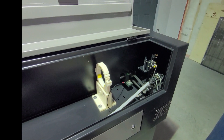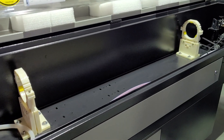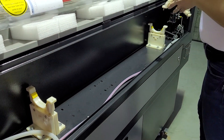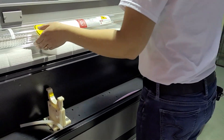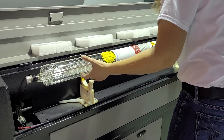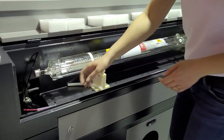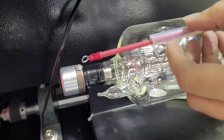After finding your correct Allen wrench, you're going to need to loosen the screws on the top half of the saddles. For the video's sake we've already done that, so I'm just going to take them off and place them aside, and then ever so gently take your tube and place it into the bottom half of the saddles.